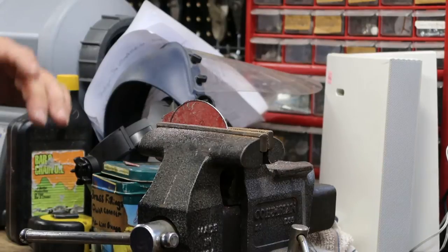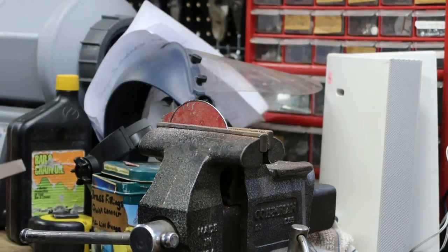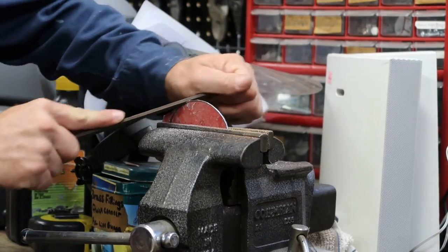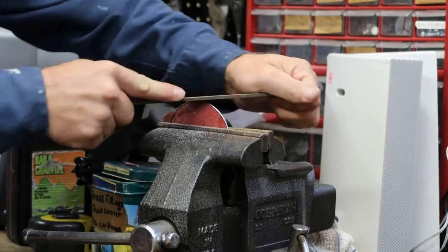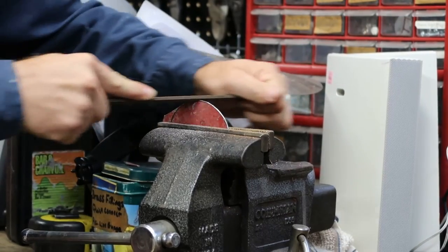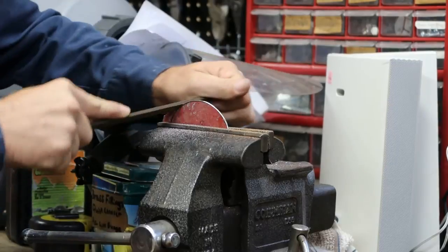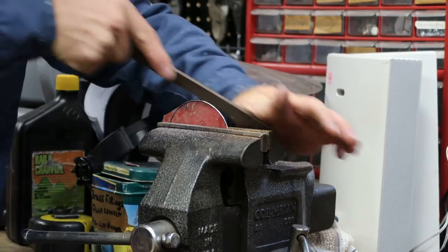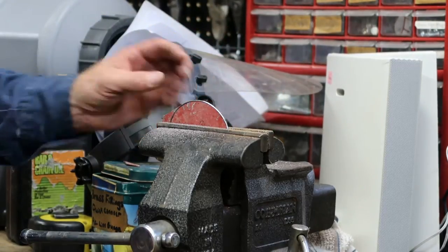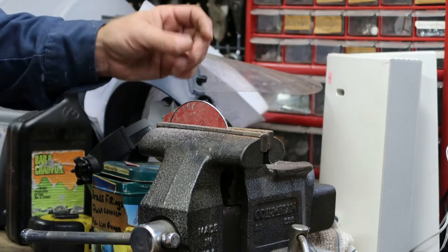We've already got it going around. Now I'll show you — take this flat file. This one's a little rusty and dull but it works. What we're going to do is just shave it and stay outside that damn line. We want to knock all the high spots off. If you angle it on the sides you can get all the little burrs off so they won't gouge you. When you're done, take a marker and run it all the way around the edge, then lightly file all the way around — you can see where the low spots and high spots are. You don't have to do that, but you can if you'd like.